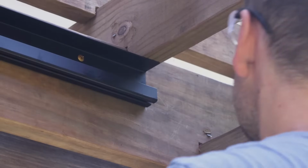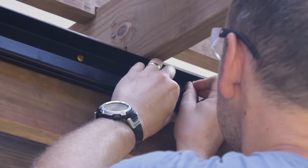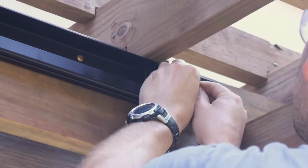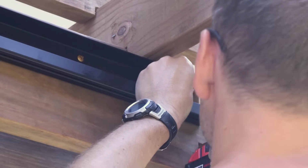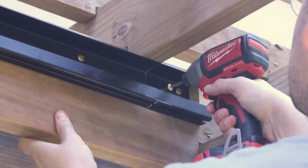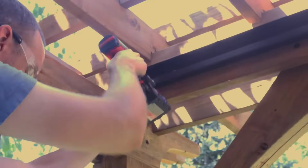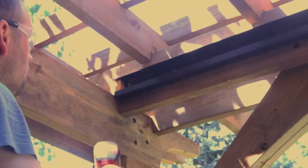With the shade fabric in place, the end caps can be added to the tracks. These are simply short pieces of track material with stops attached that keep the shade from rolling off the track. Attach these to both tracks using the included screws. Note that these end caps can be removed, and then the shade rolled out of the tracks for storage during winter months.